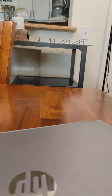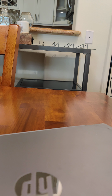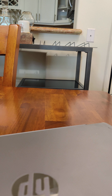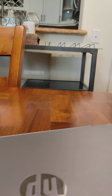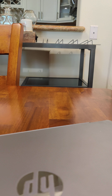And then on the furnace in the attic, it's just a recommendation to seal all the vent connections. The vent is screwed together, but we recommend tape around it. There's going to be a picture. It's the gas exhaust vent that exhausts out of the house. So the connections are just screwed together.